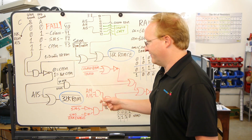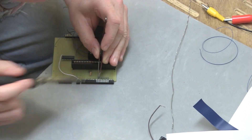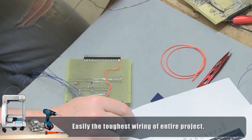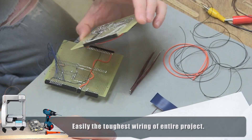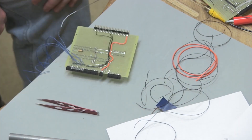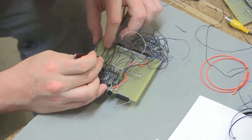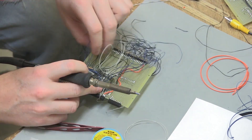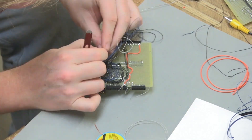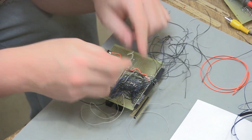So this is how the memory mapping is hopefully going to work — it's kind of like programming: if, then, and, or, but with logic gates. Now comes the un-fun part. I have to wire a parallel bus across both the input-output connectors and the cartridge connectors, so I'm basically wiring everything four times. I do the trick of using my fingernail to scrape off a little bit of plastic from the wire and then solder it directly to a pad without cutting the wire — that makes it a little bit easier to manage. I also have to be sure that I keep a clear space on the board so we can add the integrated circuits for memory decoding later on. The wires are a big jumbled mess and get completely tangled up, but to make it a little less insane, I used color coding: black is for memory addressing, blue is for data, and white is for memory control.